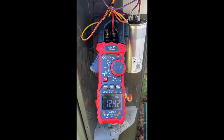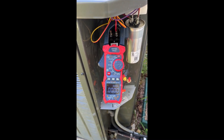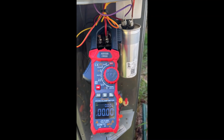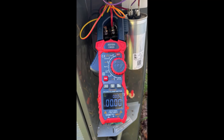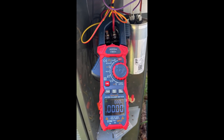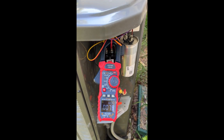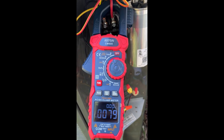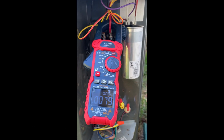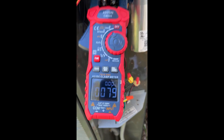These are the measurements before installing the Hyper Engineering soft start. Now just for comparison, I shut off the unit and increased the temperature so the compressor and condenser fan would shut off. I set up the meter to max mode instead of inrush mode — this is going to show the difference between the two settings on startup. I made another call for cooling and it reads 80 amps on max mode. So as expected, the inrush mode captures a higher peak current on startup. Now we have two reference points.